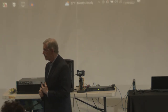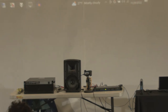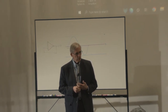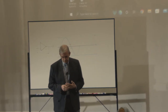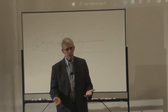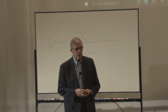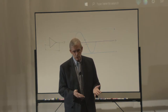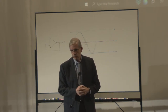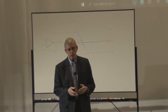I'm not sure if it fits in this discussion, but when an amplifier is noisy in its idle state, where is that noise coming from? Generally always coming from the preamp or the input amplifier. Chris's question was, if you get an amplifier and you hook it to a speaker with no input and it sits there and hisses at you, where is that noise being generated? And the answer is typically in the preamp, because if it's generated in the driver, there's not enough amplification between the driver and the output to create that kind of a hiss. The amplification from the preamp is the greater one.